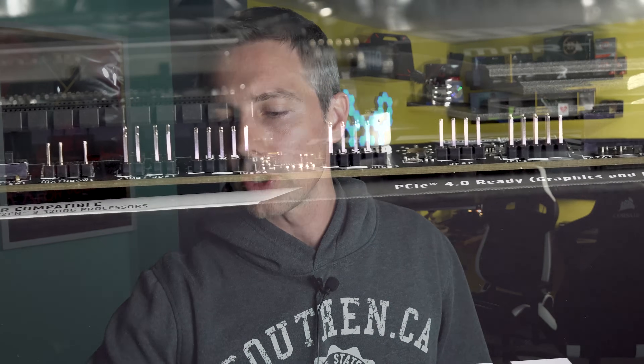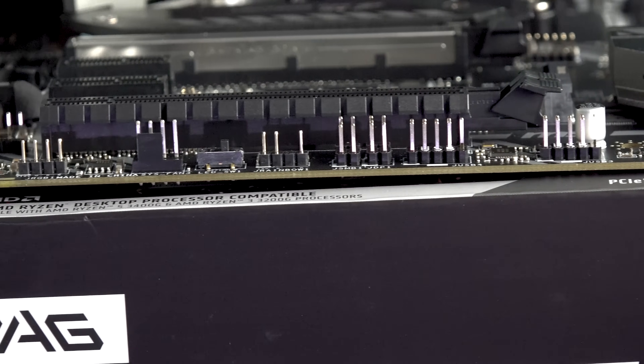In conclusion, a lot of eyes will be on MSI's Mortar and Tomahawk series. The $180 Tomahawk is a great value overclocking board. MSI improved it significantly over the B450 Tomahawk by using a six-layer PCB and doubling copper from 1 oz to 2 oz, making it feel noticeably thicker and more solid. They also integrated the IO shield area into the heat sink using an alloy construction, giving it a functional and premium feel.